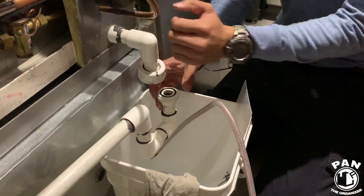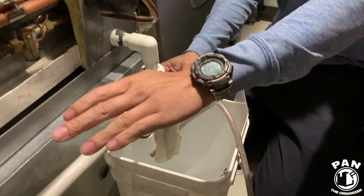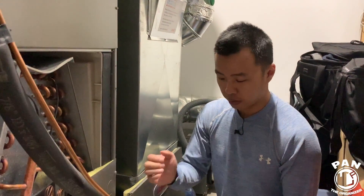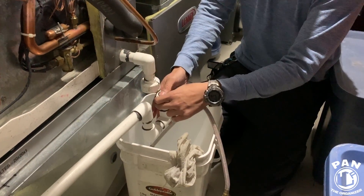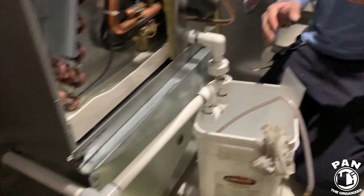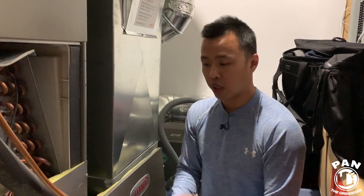As a homeowner, alternatively without a specialized tool, you could get an air compressor — same thing: pour some water in here, get a little seal around your air gun, shoot it in, and it'll flush it out. If you do not have an air compressor, you could get a shop vac or wet vac: fill up this trap with water, plug it on this end, go to the drain end, and vacuum it to give it a nice suction to clean it out. Those are two ways a homeowner can clear out their drain.